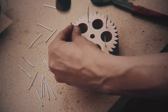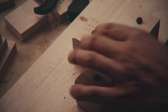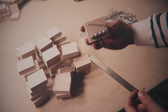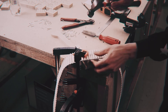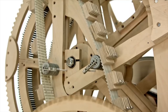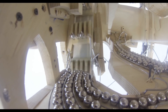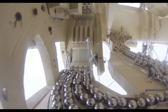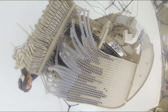Here you can see the system we had on the first machine. Everything was handmade — even those timing belt gear wheels were hand-sawed on the band saw. I was drilling and nailing millions of nails manually into these wooden blocks. Every nail was manually put in there, and the marbles could ride on these small blocks that I put on this timing belt. The blocks were going round and round, and the idea was to lift marbles up this way. It looks super cool and it's a super stupid idea. Here you can see some of the problems. In the video we used clips where it looks like it works good, but we had so many issues — the marbles are like sprouting everywhere. There it picked up more marbles, and there it didn't pick up any marbles at all. You can see here it is chaos, with marbles flying everywhere, everything getting stuck.